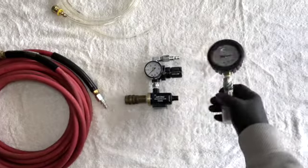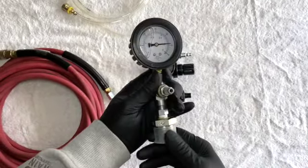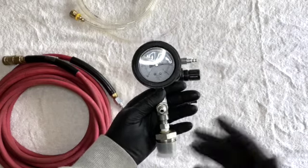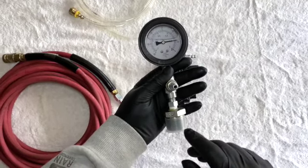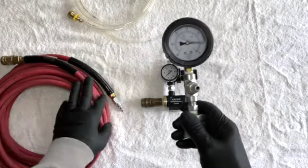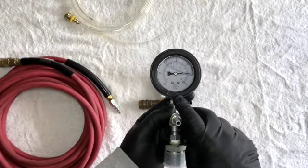So then the third thing I just set up was an adapter. This is 1-inch pipe, and you just spin out the little vent that the Tiger Cat has there at the top of the hydraulic tank, and then Teflon tape that up and just spin it in. And this will accept the other end of the quarter-inch line. And I put a vacuum gauge on it here.